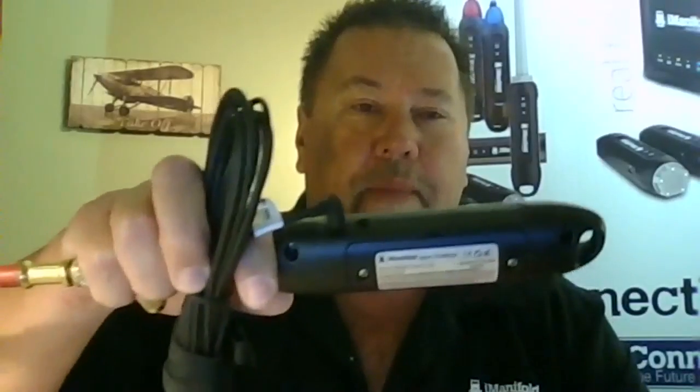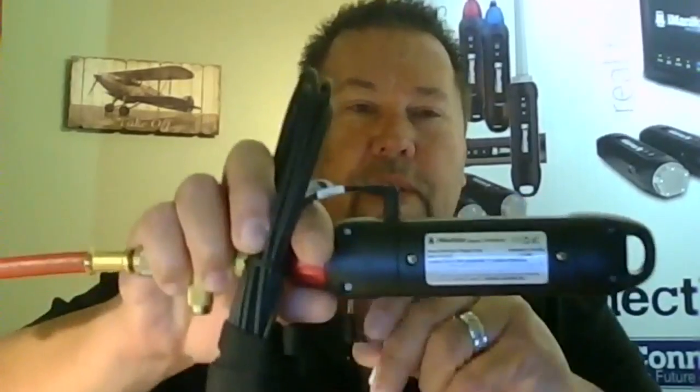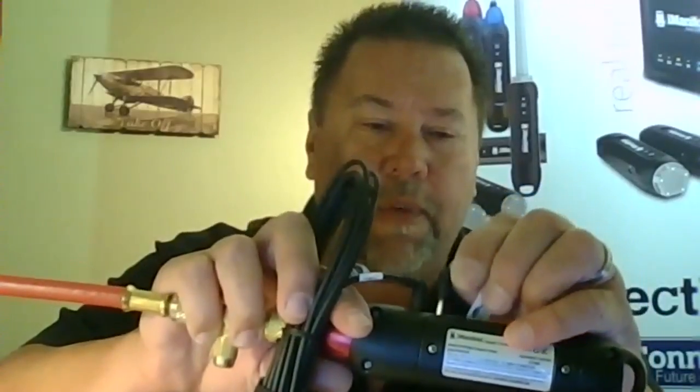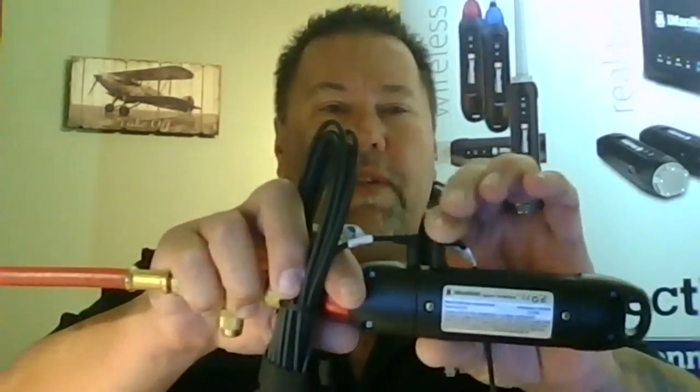So discharge line temperature can easily be taken right here on our high side probe. T1 is going to be our liquid line as we plugged it in. Now, if you want to take discharge line temperature, you go into T2 and snap that in. And here in just a second, when we fire up our app, we'll show you how that comes into play.